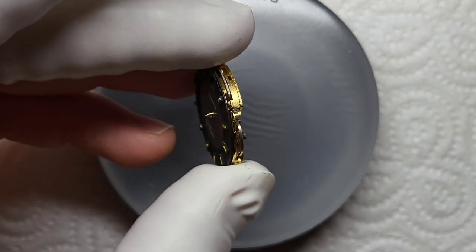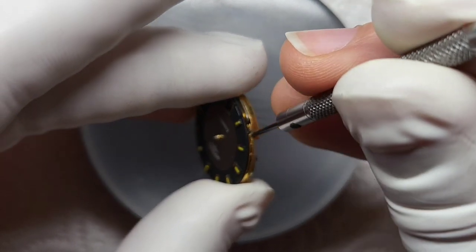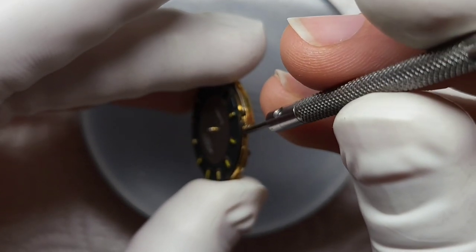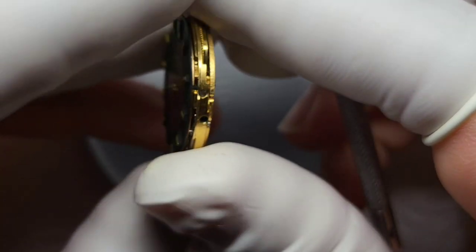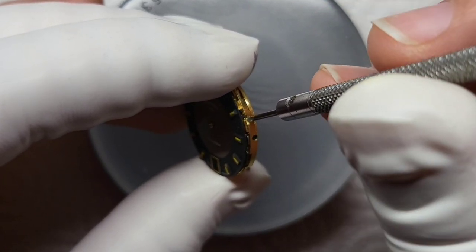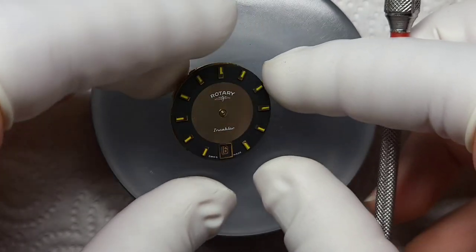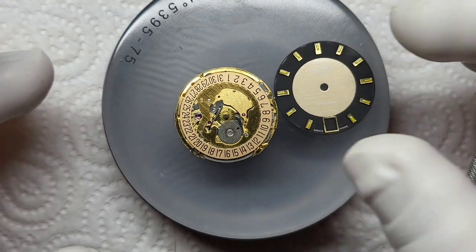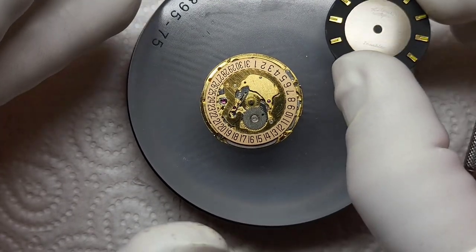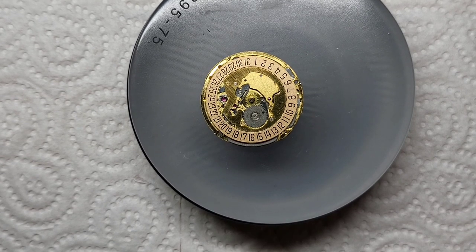Back to the watch. The face itself has got two pins on the rear and two screws retaining the face to the actual chassis of the watch. By undoing these pair of screws, the face should be just about ready to come off. The face of this watch is actually in quite remarkable condition — straight off, and now you've got that lovely view to the front side of the watch. That doesn't need any work at all — just chuck it to one side.